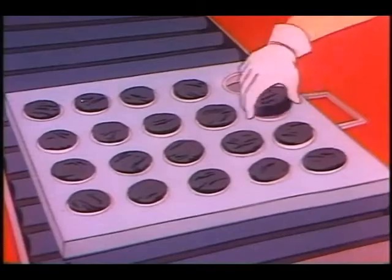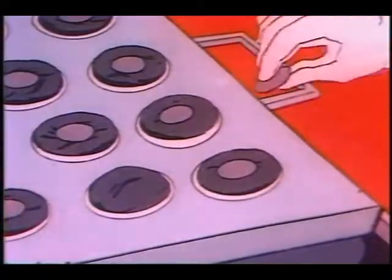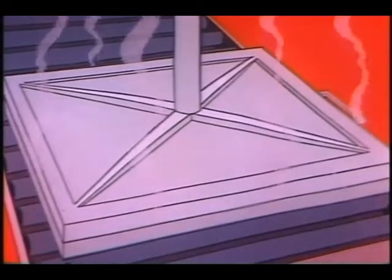Individual pucks are cut off at 1-inch slices. These slices — my relatives — are put in a vulcanizing tray. Team insignias are spotted in place. Then the tray cover is secured and 2,000 pounds of pressure is applied while we bake for 20 minutes.